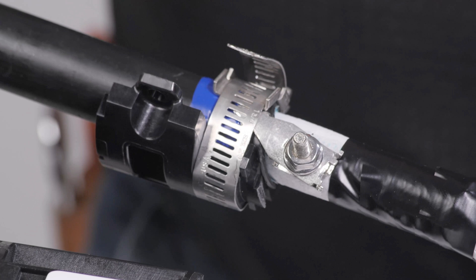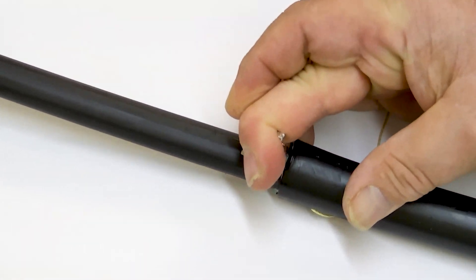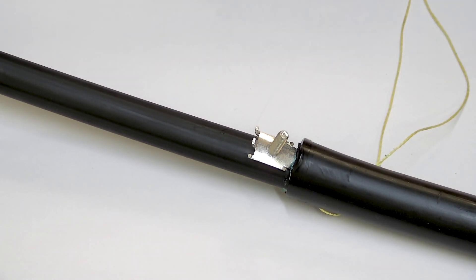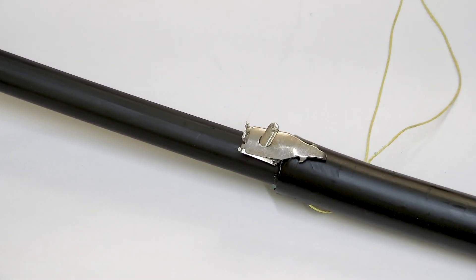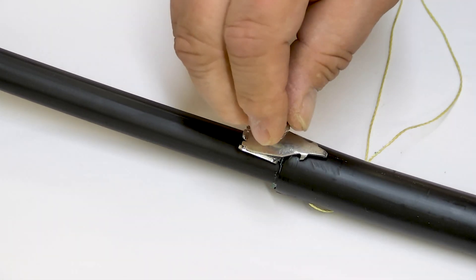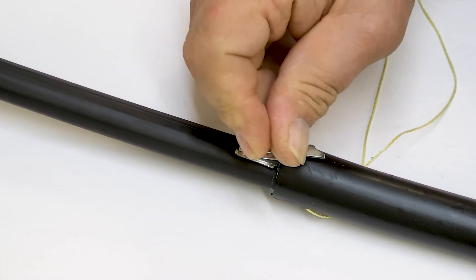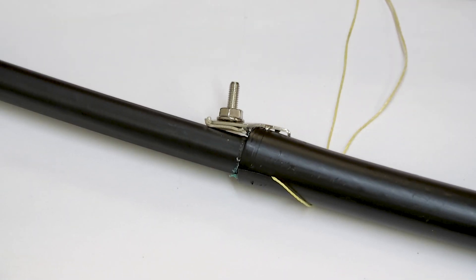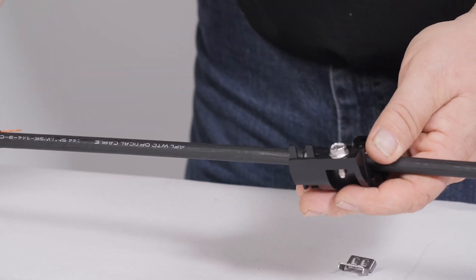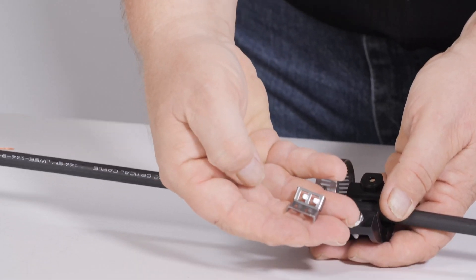The final position of the ground attachment should put the ground lug on the side as the cable attachment unit is installed. Slide the ground plate attachment into the armored layer. Once seated in the proper position, assemble ground retention. Tighten ground on armor per manufacturer's recommendations. Once the location for cable attachment is determined, orient the cable attachment unit and slip the hose clamp around the cable. The hose clamp gear should nest into the cable attachment unit bracket.